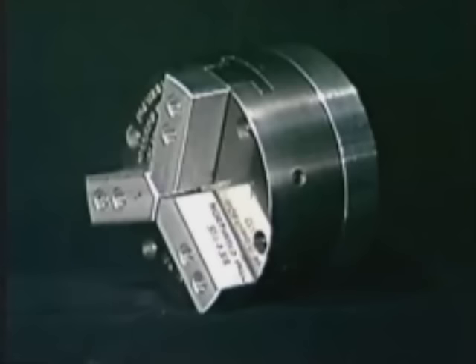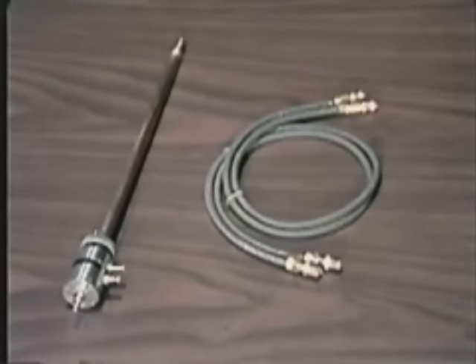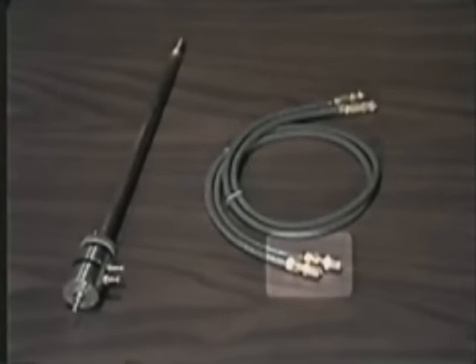This is a precision instrument and should be treated with great care. Notice that the chuck is shipped with the jaws in the full open position to ensure proper mounting. It should also be unmounted and stored in the open position. The air tube should be straight and free of dents. Examine the threads, hoses, and quick disconnects for damage.